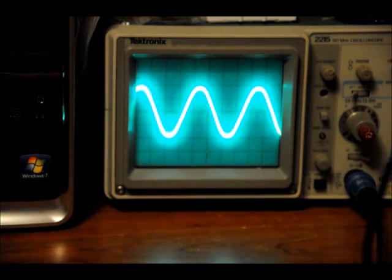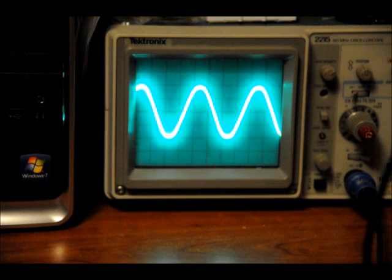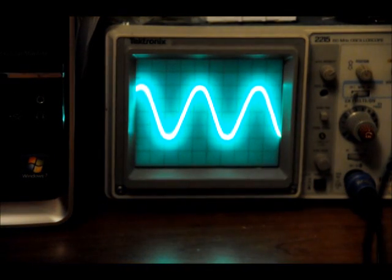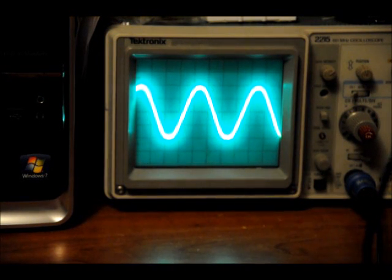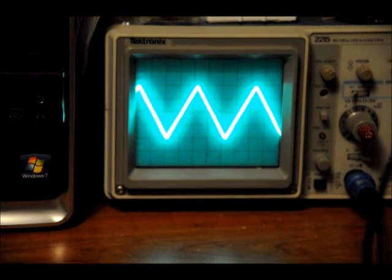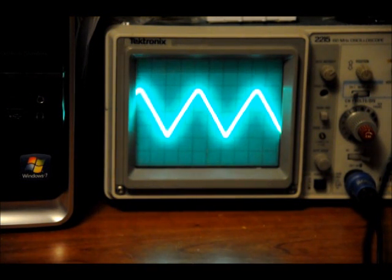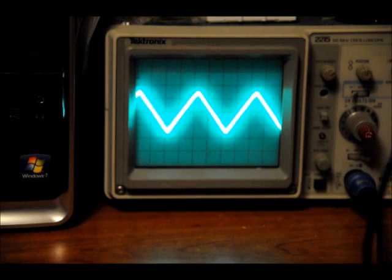Pardon the triggering on my oscilloscope. Bring the positive amplitude up to about 2 volts, then set the offset to match the negative swing. Right now we've got just about 4 volts peak-to-peak: 2 volts positive and 2 volts negative — it's a nice-looking sine wave. Then bring the amplitude down to get a non-saturated triangle wave. When the triangle wave has a flat top and flat bottom it means it's being saturated, so adjust the amplitude to get a nice triangle wave. There's your sine wave. There is your triangle wave.